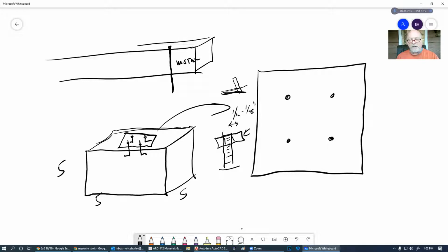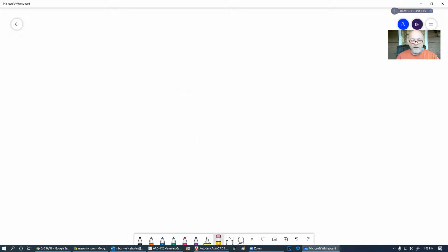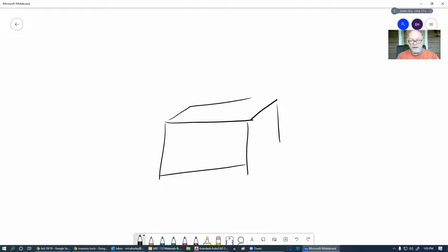In some cases, when you're doing really, really large beams, they'll use 2 nuts. You'll have that footing coming up, and the top of the anchor bolt will be out of there. They'll put a nut down here, put the beam on, and then put another nut on top of it. Now, what does this do? Because I can move the bottom nut up and down by turning it, if I didn't get this footing perfectly level, then I can use this bottom nut to go up and down with the whole thing, and everything's perfect.